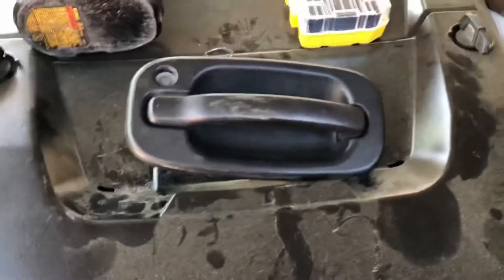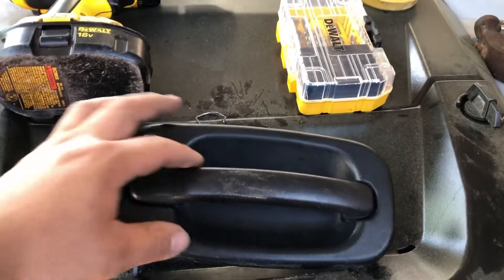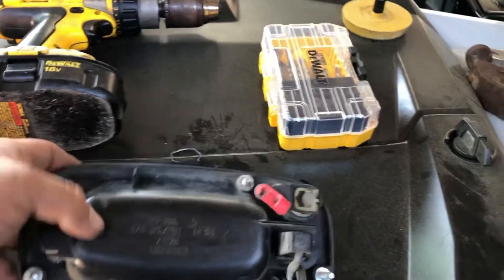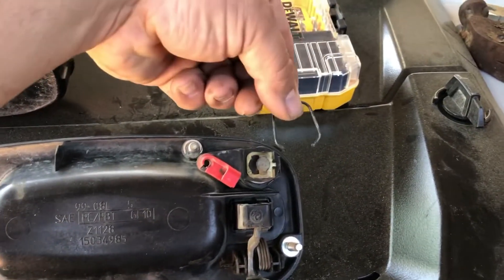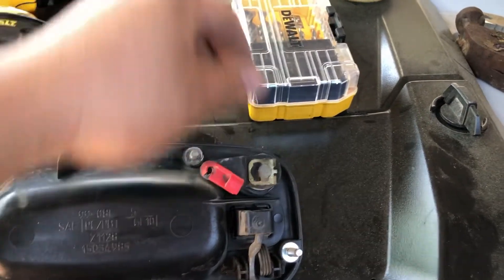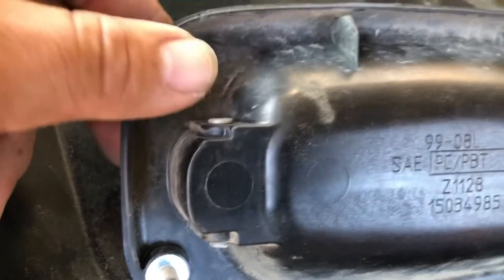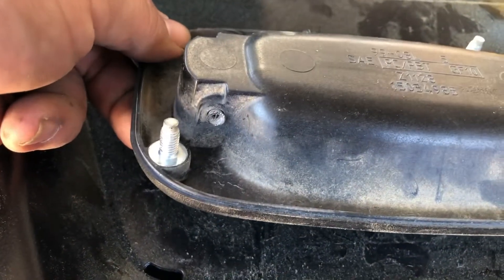All right, so here's the door handle. In order to paint it and prep it the right way we do need to remove this center piece — the actual door handle. So flip it around. First thing I did was remove the cylinder lock — I already took off the little spring that was holding it down, popped it out with the flathead, and once you pop it out it comes off pretty easy. Now for the door handle itself you got a spring pin there. There's a head and here's the bottom — it is flared out, almost like a mushroom head.